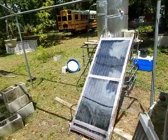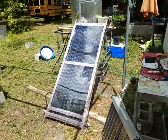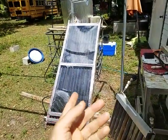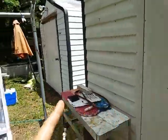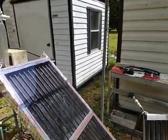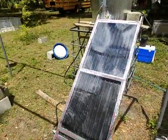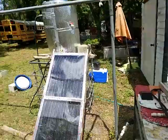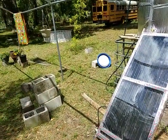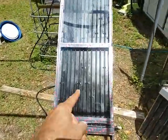You want at least five good hours of sun. It did get sunny here about noon, and if we still have sun at five this would be a possible location because it's closer to the shed where the output of the hot water is going to go to the washing machine. However, one has to compromise — you want sunlight above all, so the losses from moving it to the middle aren't going to be greater than the gain from the extra sunlight.